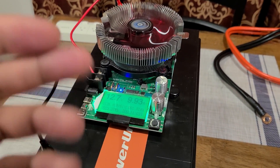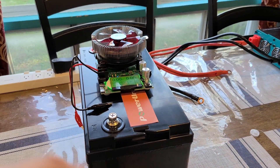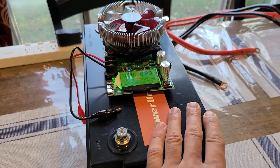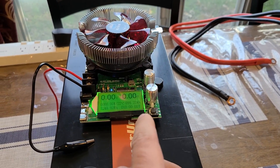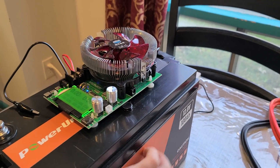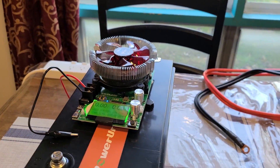The capacity test is finally finished after about 10 hours. The load tester did turn off and the battery capacity is fully depleted. What I ended up getting was a 99.22 amp hour reading. This battery has a rated 100 amp hours, so we're getting about 99% efficiency on the amp hour side.